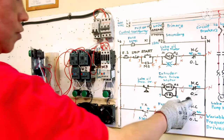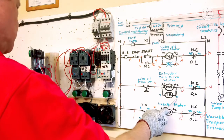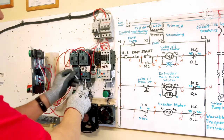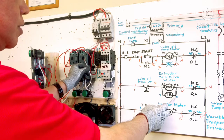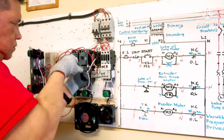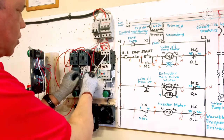Next one, we are done here. So next one, 95 neutral going to A2 and going to timer, terminal number 2. Neutral. 95 M2. Okay, done. 95 done. Done here, going to A2. I need 1 extra wire going to terminal number 2. Terminal number 2 here. Okay. I connect together to M2 A2. I get 2 wire now, 1 wire going to timer terminal number 2. Neutral. Okay.